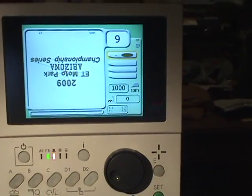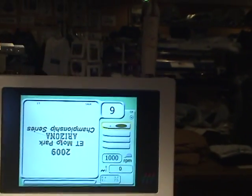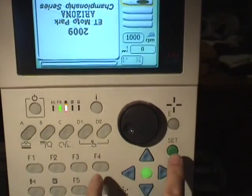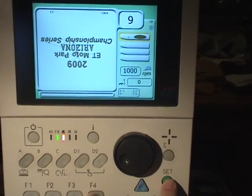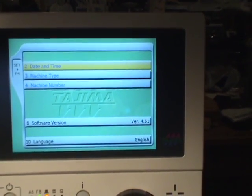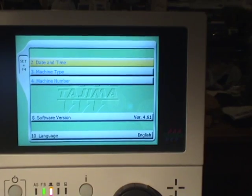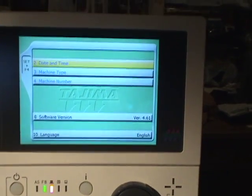Now we have a USB stick with 4.7. The prior version on this machine can be checked by pressing set from the home screen, set and F4 together, and down on line 8 it displays 4.61. That's the current version. We're going to upgrade to 4.7. So,